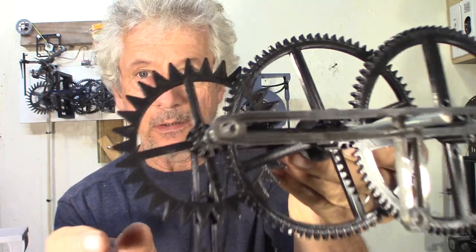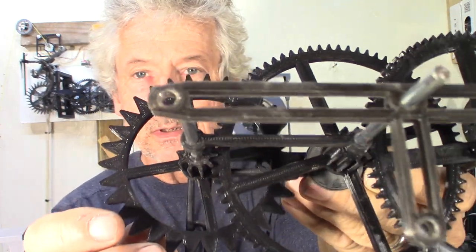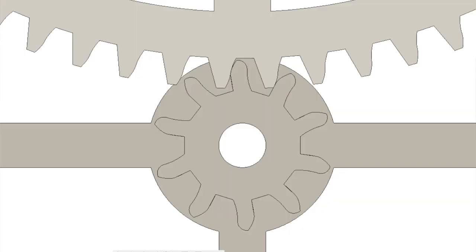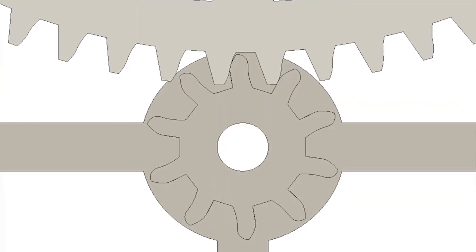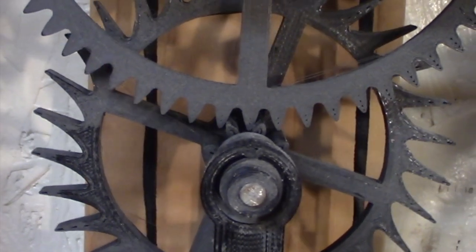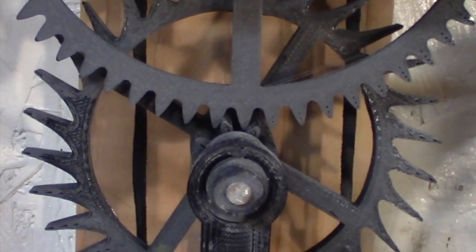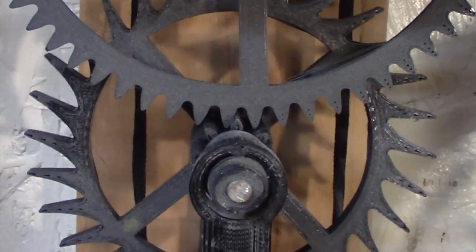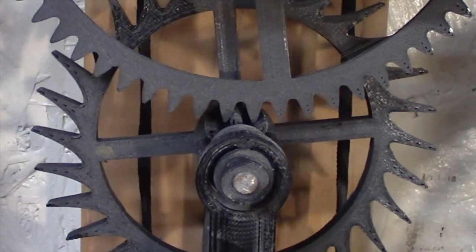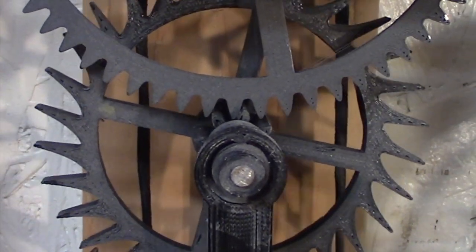The next thing I did — I cut off some material on the back side of each tooth. The way I've done the backlash messes up the geometry of the teeth. You can see it on this clock here — see how much space there is between the teeth. I believe that it's not good for the geometry, the engagement, so the teeth slip against each other instead of rolling.